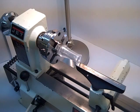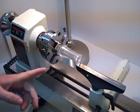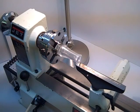Just a second about the barrel. First thing I did was, after I took the raw acrylic, turned it to the shape that I wanted. At that point, I progressed to wet sand the barrel down to about 10,000 micromesh. It's often been said that 600 grit is about as much as you need to do as far as the sanding is concerned. I have a tendency to go overboard with a lot of things, and therefore I do on my duck call barrels as well.